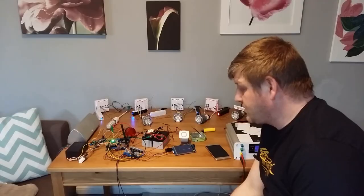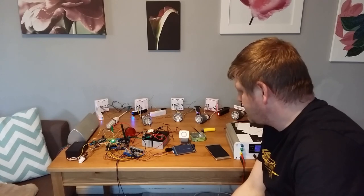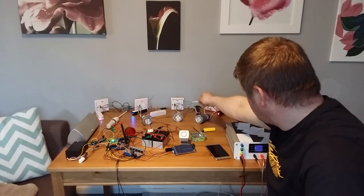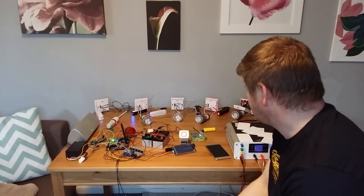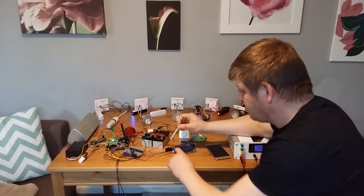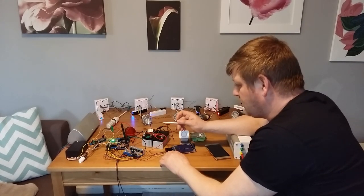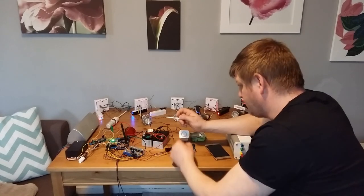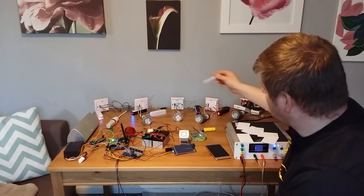So the hardest work was to create the software for this one, because here I have created one software for each part, so there are five codes written. Then also one software for all this display, because it's also a microcontroller that communicates with the Mega through serial, so TX-RX. So another software for this one in order to communicate with the base, then another software for the base, and another software for the card reader, in order that I then made them communicate.